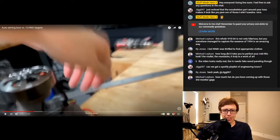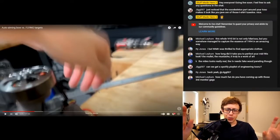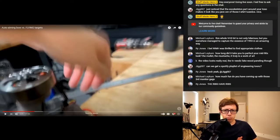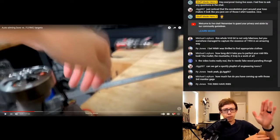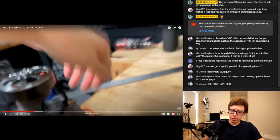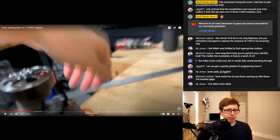That was basically the representative issue with the O-Drive. I spent at least a week on this. I was having issues where I was effectively stalling the motors for a bunch of different reasons. These motors are made for a quadcopter with a propeller blowing air over them constantly — which isn't happening here. So when I run them at their max rated current, they can really only do that for a little bit before they overheat. I could do it for a spike to move the bow and fire, because that's a really short event, but if they stalled, they would burn up. I just kind of gave up on them. I want to go back to it — it's a really great board and it can way outperform the stepper motors I used, but I just had to get this thing done.